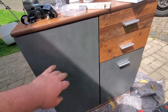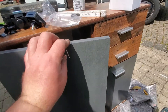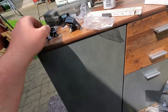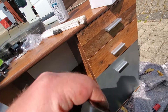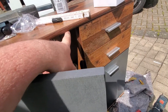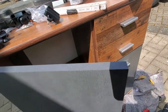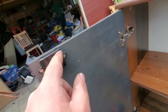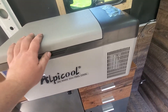So here I got one of my cabinets and we put a push-lock system in here. We have to drill a hole this size, measure it so it goes right on the top like this, and then make a little slit where the lock actually locks in place. Lock is in there — I put some paint on here so I have a mark. This one is already installed, nice and flush right here.